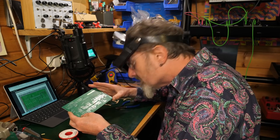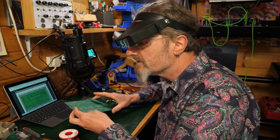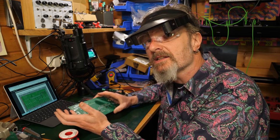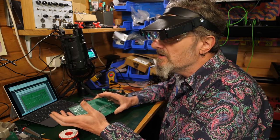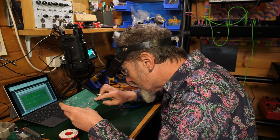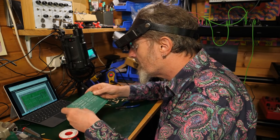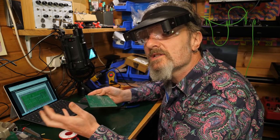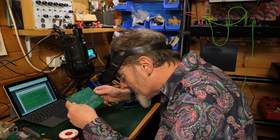As I say, you can do it in batches, you can do the whole lot at once. Having a lot of resistors together that you're soldering, sometimes the legs can get in the way of what you're doing, and that can be detrimental to the flow of your solder. So perhaps do some which are spread apart, then do the next lot, then cut off the legs and then do the next lot. Yeah, there's wisdom in that, certainly.